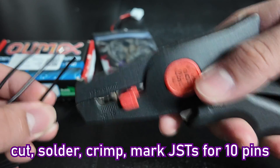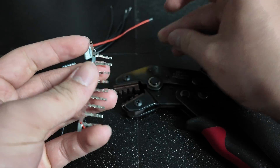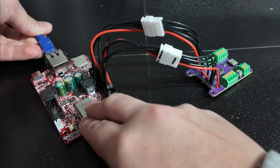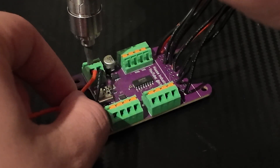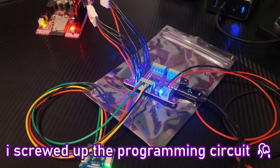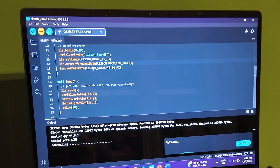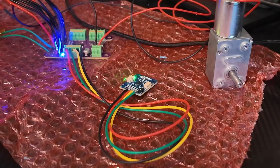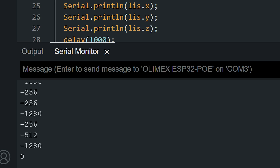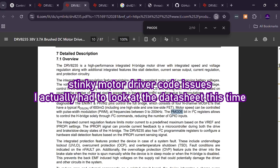Now it was on to the construction — and I think you guys are gonna like this part because you're gonna see me suffer a lot here. Enjoy! By now this is already like three hours in, which just goes to show you how fun crimping wires yourself is. After plugging everything into my computer, I soon realized I had screwed up the programming circuit because while it works for ESP32-S3 and C3, it won't work for the base ESP32 for some weird protocol reason. Anyway, I got the sensor working after a few hours, and then I got the motor driver working after a few hours because I didn't know how to read registers in a datasheet.